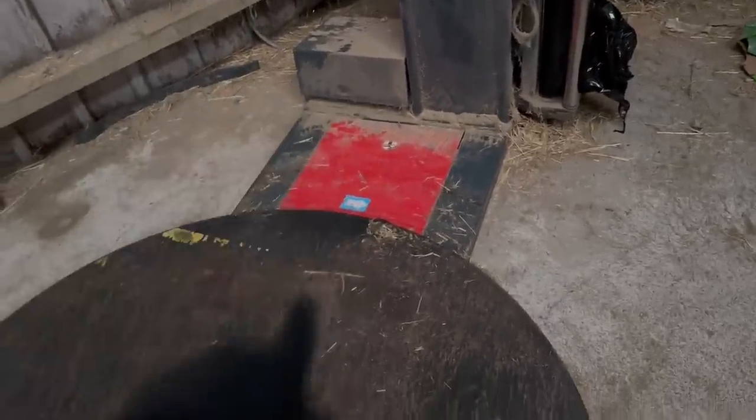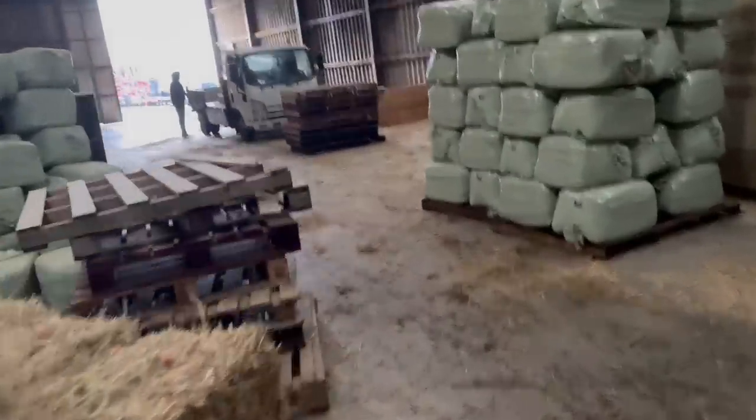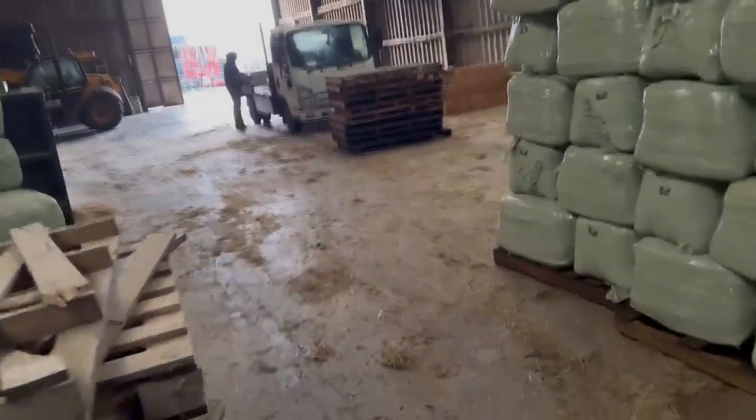So, under this plate is a great big chain that goes up to the power point up there. Now, sometimes plastic gets dragged into the gap inside and it makes the chain jump, so that's what's going on. So we're going to take this big plate off and then that red panel, and then we'll see what the problem is and sort it out. Meanwhile, Charlie is going out to delivery, so he's just prepping the load up.